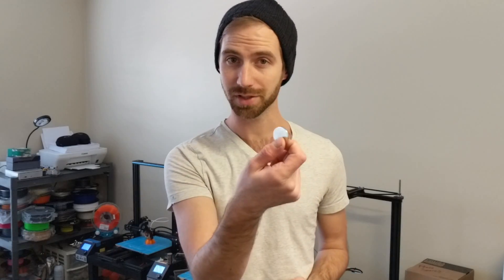The bigger neodymium magnets are what I'm going to start using for all my build plates going forward, but I'm not going to use the foam double-sided tape that comes with them. Instead I picked up double-sided clear silicone tape at Home Depot — it's incredibly sticky and once you stick it on you'll have a hard time getting it off, so make sure your magnets are positioned correctly first. It's silicone, so it's more heat resistant than foam padding. With foam padding the magnets aren't as strong because of the gap the foam leaves — silicone is a much better choice.